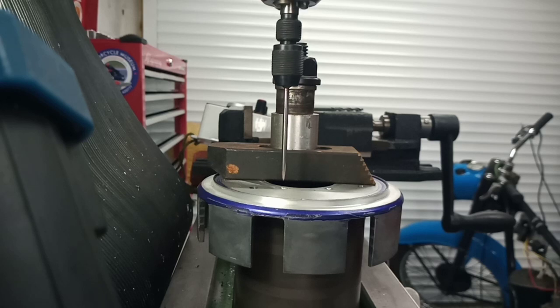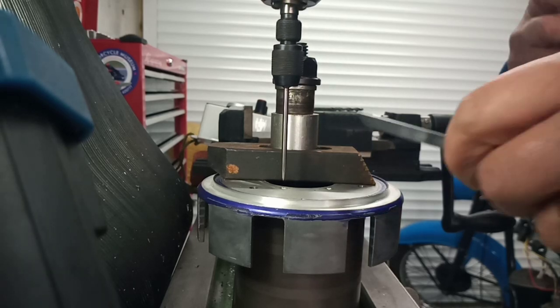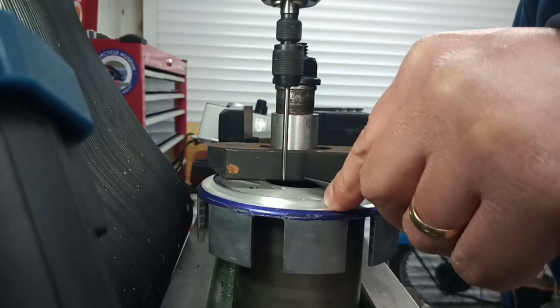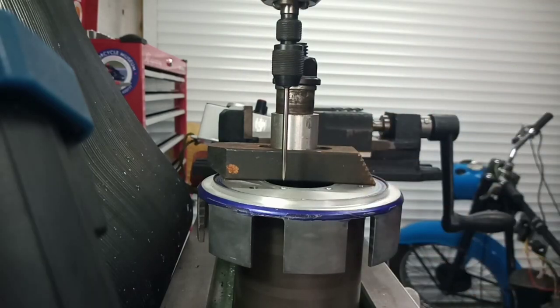We haven't got 2D. So we're going to be using 4.8 rivets. So that would be like a 9.6 millimetre land. And we haven't got that. We've got about, well, I don't know. Let me have a measure, because I've forgotten, quite frankly. Yeah, we're near a 6. So not ideal, but we'll be all right, as long as we're careful with the countersink.